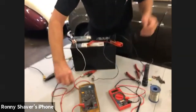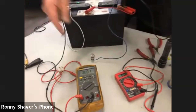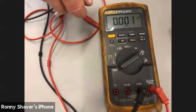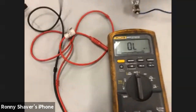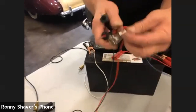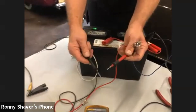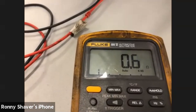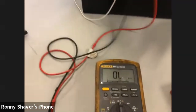Let's start with this bulb right here. I'm going to take my test meter and go to the voltage-ohm setting. That's a diode symbol there — this meter actually tests diodes too. I'm going to change to the ohm symbol, get my leads back on, and check the resistance in this bulb. Before you test, touch your two leads together to get your baseline. I've already got four to six ohms resistance just in these wires — the leads are kind of old, so that's part of the problem.